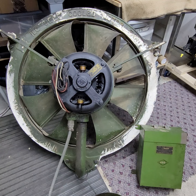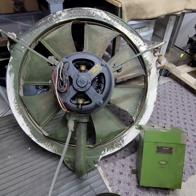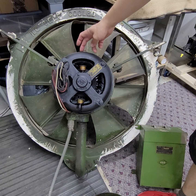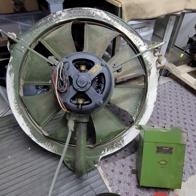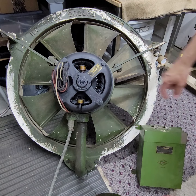The interesting thing is you can wire either of these motors for either voltage. If I wired this in star, I could run it at 220 volts, or the other way around — if I took the blowers and wired them in delta, I could run them at 110 volts. That's old terminology these days; 120 volts is usually the standard. The house I'm in is more like 125 and 250, roughly. On the top of these motors, cast into the actual housing of the stator, it has numbers punched in there — it says 110 and 220. So even though the blower tags just say 220, you can also wire them to work on 110, just like this fan. I may try rewiring this in star and hooking it up to my phase converter to see what that does.